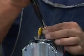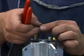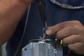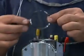Pull out the brass seat and the plastic high pressure seal. Then pull out the wavespring and slide off the outer centralizer.